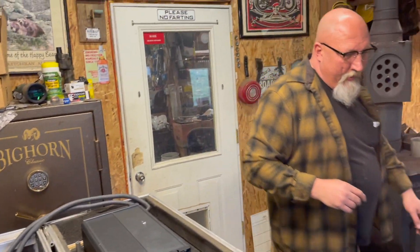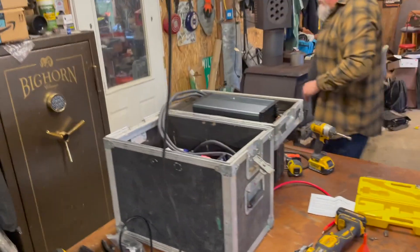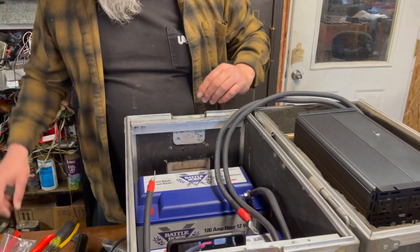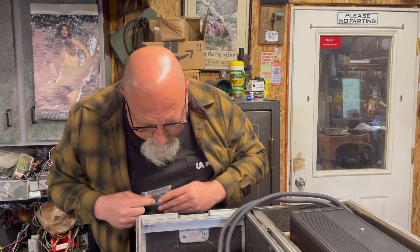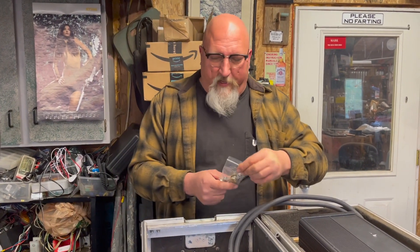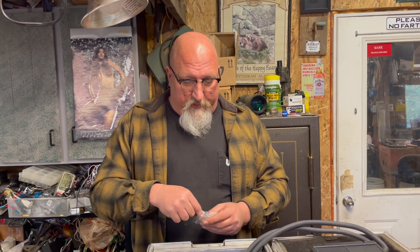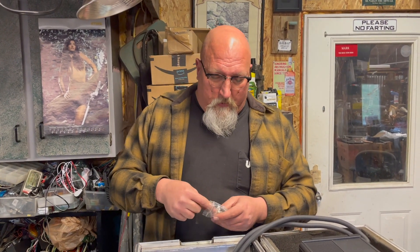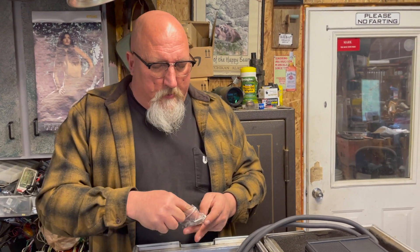So what we're going to do now — kind of a cool thing — is hook everything up. This inverter has big capacitors that charge almost instantaneously, which means there's going to be a lot of current very fast. It's going to make a big spark, and that can be scary the first time — you might think you hooked something up wrong or fried something. No, it just makes a big spark. Whenever you're hooking up a big inverter to a fully-charged battery, it's going to make a big spark. You can alleviate that by running it through a resistor, but it'll be less fun.